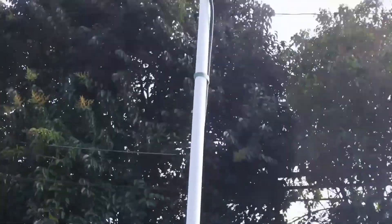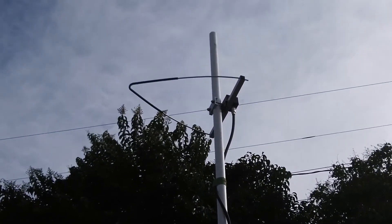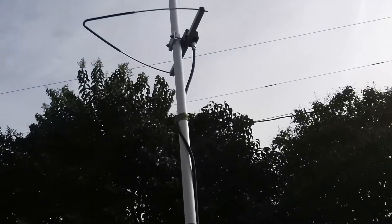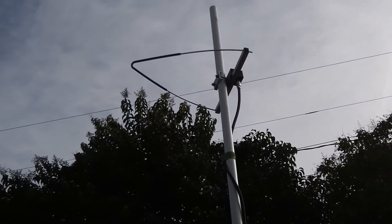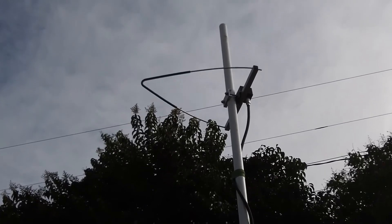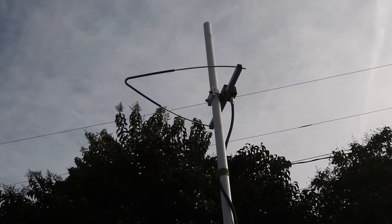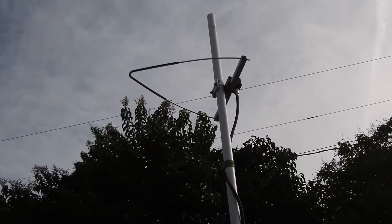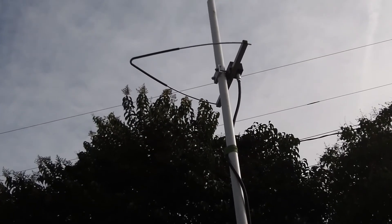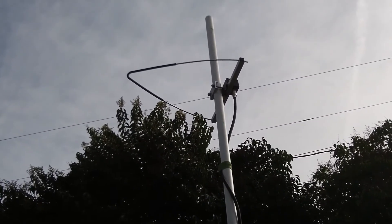I've got the omni-angle down below the top of the mast because I was getting some reflections either from the ground or from the wires nearby. I was experimenting — moving the antenna up and down should show the level going up and down, which is indeed what happened. I'll show you why that was done, because we have the dipole and this antenna compared directly. This antenna should have less than dipole gain, but it actually shows a little more on this test range. So I think I'll need to repeat this in the front yard where there's less clutter.